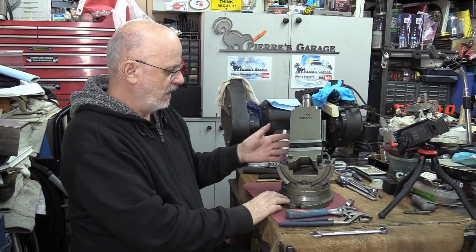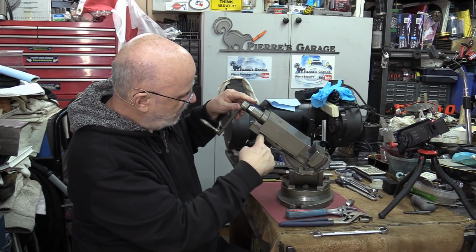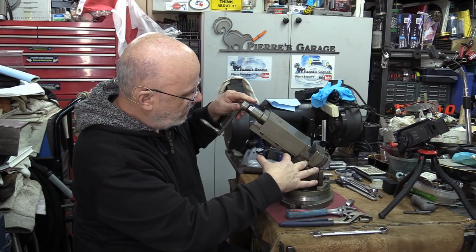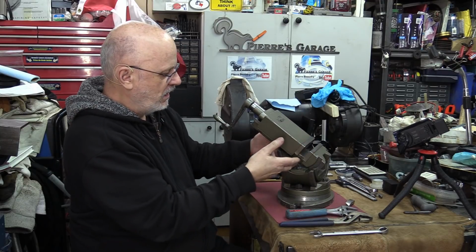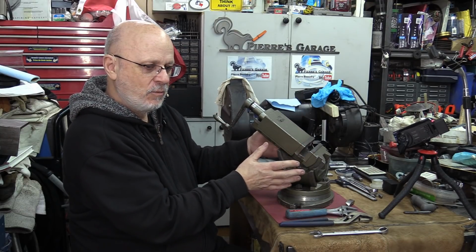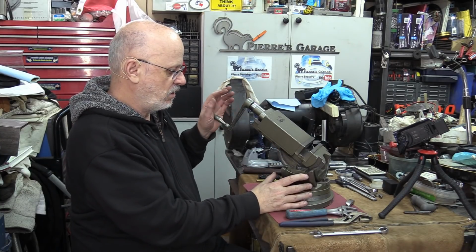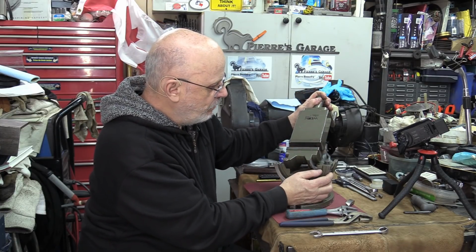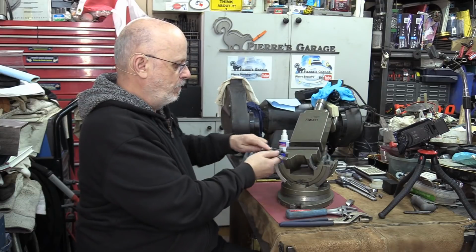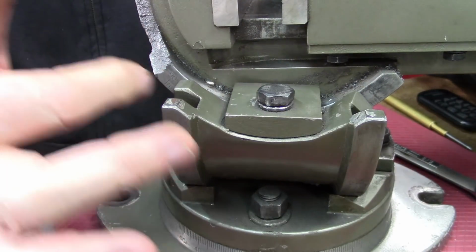Also, if you're talking about making a repair, like in this part here between the jaws, you might have a few thousand pounds of pressure between there. So there, a weld would be more likely, or solder, like silver soldering or bronze soldering. But this slide here, I'll just untie this a little bit. There you go. This slide here is a continuation of the slide here.